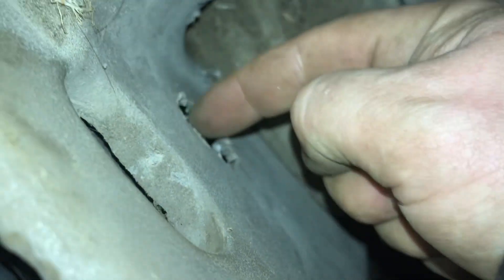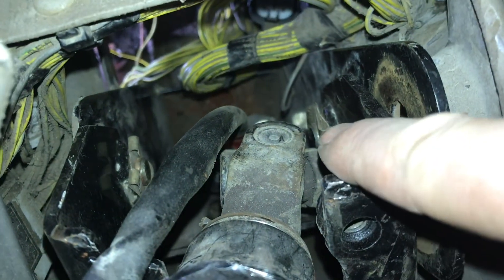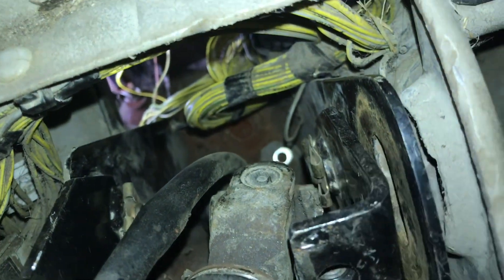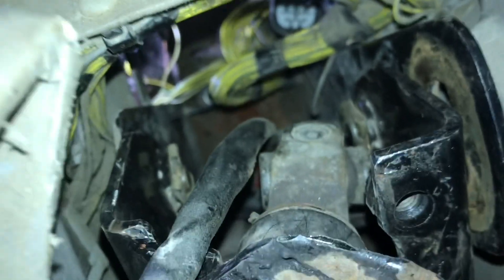There's a little tiny bar across here to make it extra difficult. This panel had been welded so it was very difficult to get out. What we did was drill a series of small holes to find the bolt that the column pivots on. We removed the clips and the pin, which allowed the panel to pivot slightly sideways. We bent this bar back a little, which allowed it to pop out. There are also two looms to undo, which were both undone.